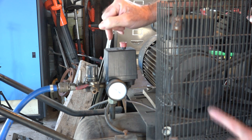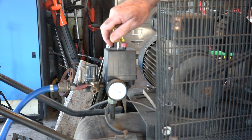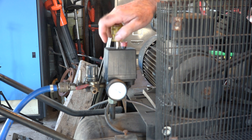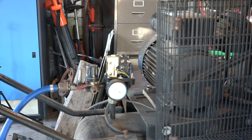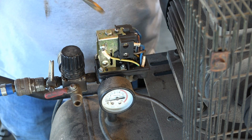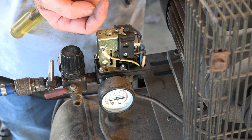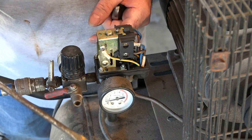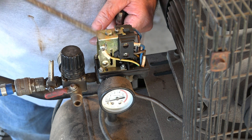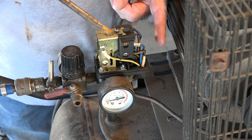It works the same. I've actually got another compressor I can show you the difference, but they're all much of a muchness. Most of them are going to have a Phillips screw in the top here, so if we just undo the Phillips screw we can take the cover off. I don't suggest you do this because they're all factory set — there's a reason why they're factory set so they don't want you to blow yourself up, but anyway. On top of this thing we've got a bolt — some have a bolt you screw in and out, some have a thread with a nut. Some also have on the other side another screw thing, and if you've got one like that, that is the balance screw that balances it between when it starts and when it stops.